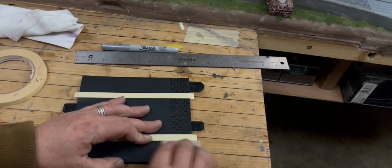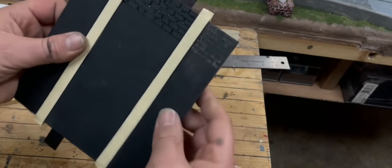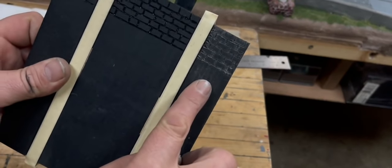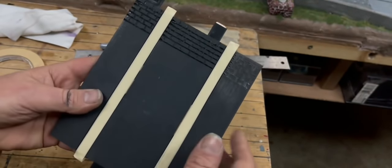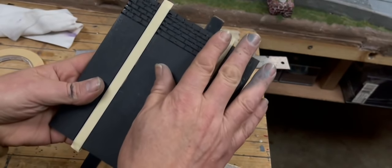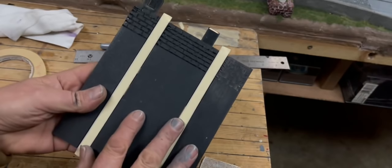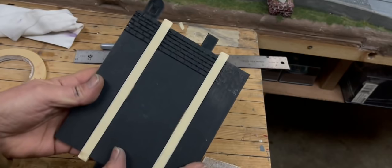And get this one side here. And that's pretty much all it takes. And now it's leveled all out. So I'm going to go ahead and finish off this area. Then I'm going to prep this track for paint, meaning I'm going to wipe it all down with some alcohol and some lacquer thinner, and then scuff it all out with gray Scotch-Brite.